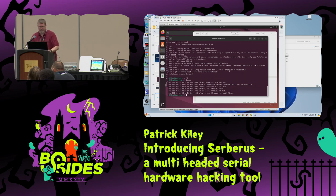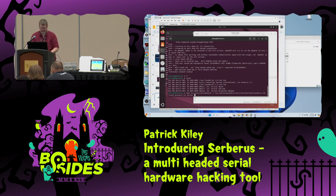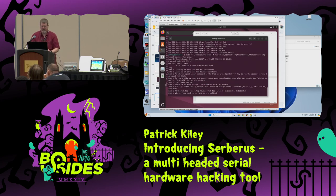Okay, it's showing up. You can see 403:6041. And yes, I know I'm running OpenOCD as sudo, and that is a bad habit. Don't do that. And you can see right here, it can see the Freescale chipset on this automotive target. This particular Freescale chipset doesn't have any other definitions supplied under OpenOCD, so I can't really do anything else exciting with it. If you were to read through the JTAG descriptor for it and define your own definitions on this, you could dump the gateway configuration.